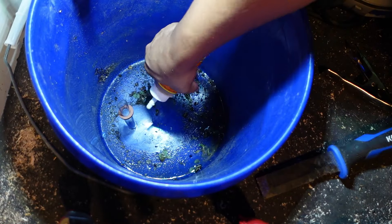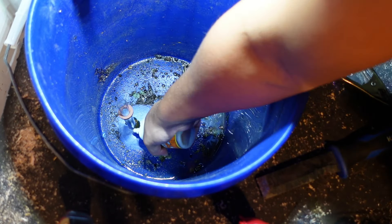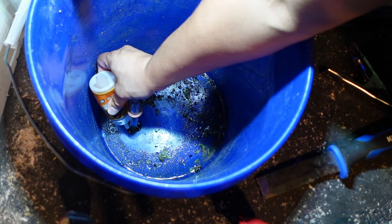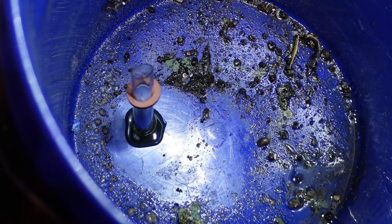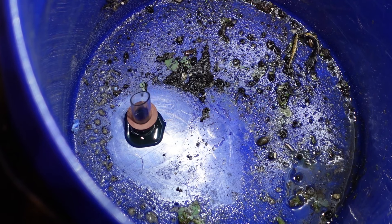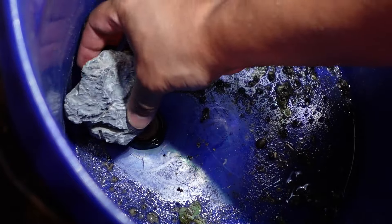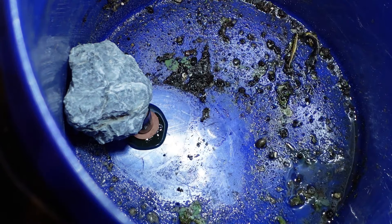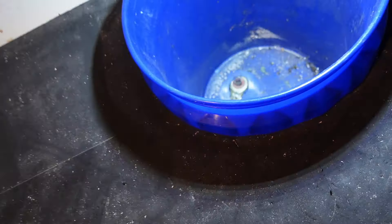The reason being is that the hose is made out of vinyl and Gorilla glue can stick to vinyl, and Gorilla glue is fish safe. Now the Gorilla glue doesn't really adhere to the bucket as much, but that's okay because it will adhere to the hose. It will adhere to the washer and it bubbles up and makes this foam wall as it raises up a little bit as it dries. You can kind of pull down on the hose to force the washer into whatever you're using to secure it. Then I'm just going to weigh it down with this seiryu stone that I have laying around — it was the heaviest thing in the fish room I could find.